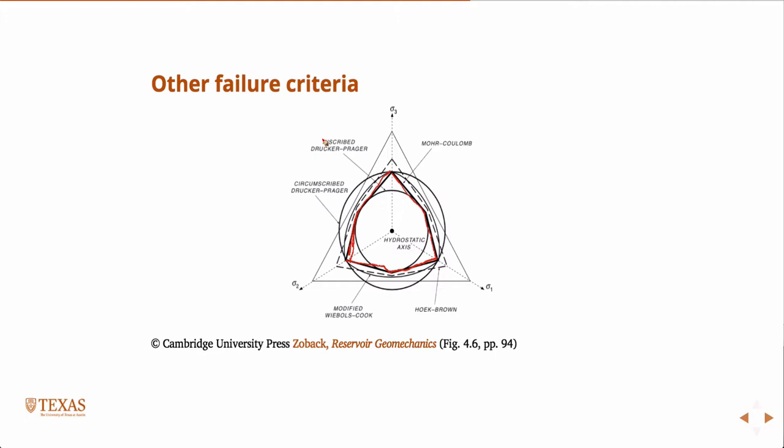Likewise, if we're applying forces, it depends on the boundary value problem you're solving, but if I push on this desk, in reality, I'm applying this load continuously; the harder I push, there's a continuous curve. But in a computer, I can't reproduce that continuous curve, I have to do it discretely, so I increment the load. I take my maximum force and divide it up into increments. I increment the load and solve the problem, increment the load higher and solve the problem, and again. Because in the computer we have to do things discretely in steps, remember what I said earlier several times: the state of stress is either inside this or it's on the surface. It's invalid to be outside. So it's inside, in which case it's elastic, or it's on the surface, in which case it's failed.